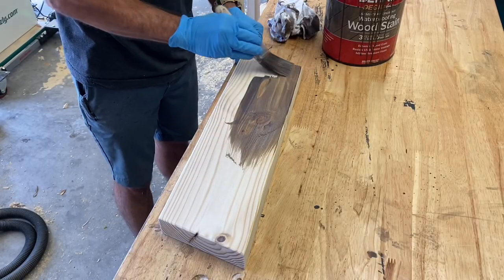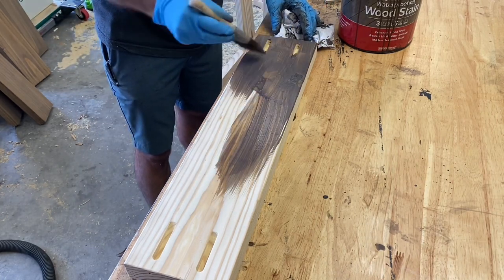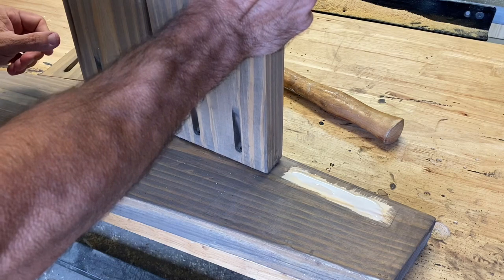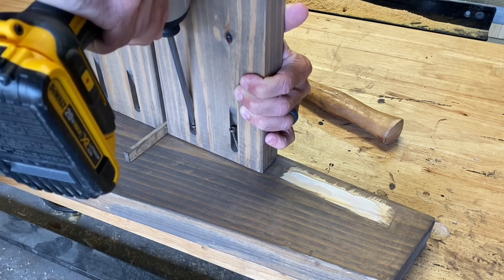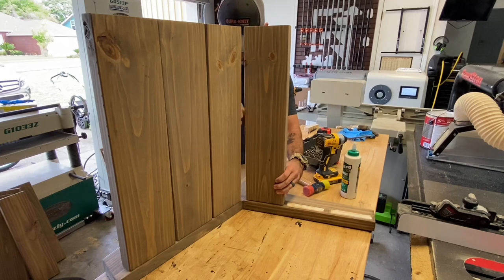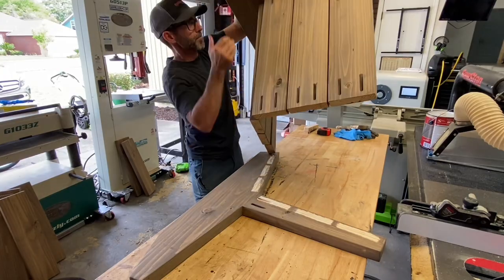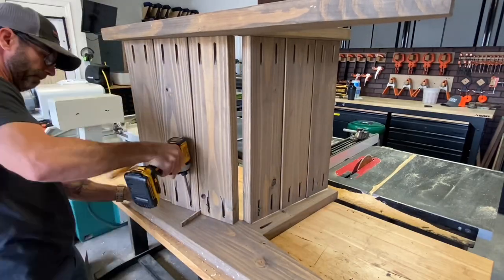Now let's do a little pre-staining — if you're not used to this, get used to it. It makes the process simple. If you want to build a project and then flip things upside down crawling into crevices to stain, go for it — but I love pre-staining. Be sure to leave spots out where you're going to glue later. Lumber prices in America have gone through the roof, so using dimensional lumber was fun — I didn't have to spend a fortune on sapele or white oak or black walnut. If I make any mistakes, it's not that costly. Pro tip: definitely do not stain in areas you're going to glue — you want raw wood so the glue soaks in properly.